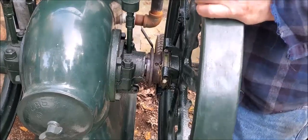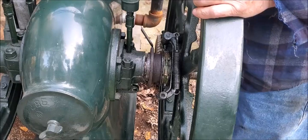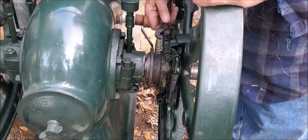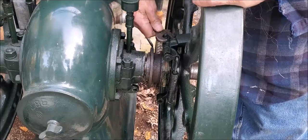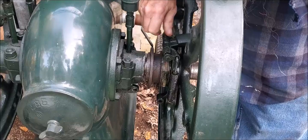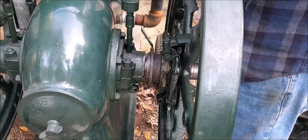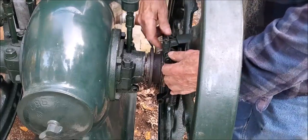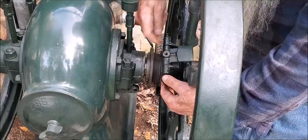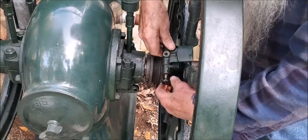The problem is the gap right in there — I'll have to take that gap up. The sliding collar, which is stuck, has been repaired; I see a brazed repair. We may end up replacing that — we'll see. Two cup-end set screws hold that together with a lock nut. Now this weight on this side has quite a bit of play between the yoke, so it would need a spacer washer, whatever is required to center it up on the gap on your flywheel. We'll set that straight when we put it back together.